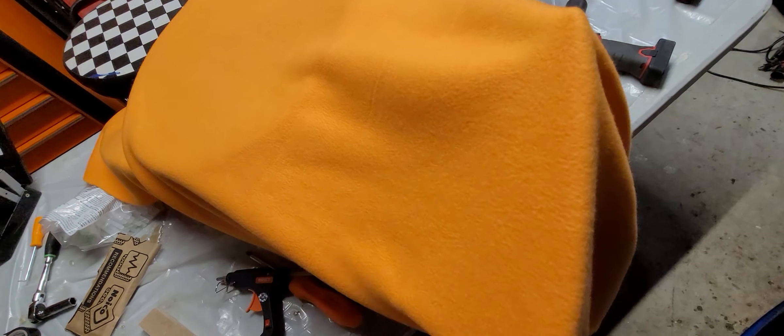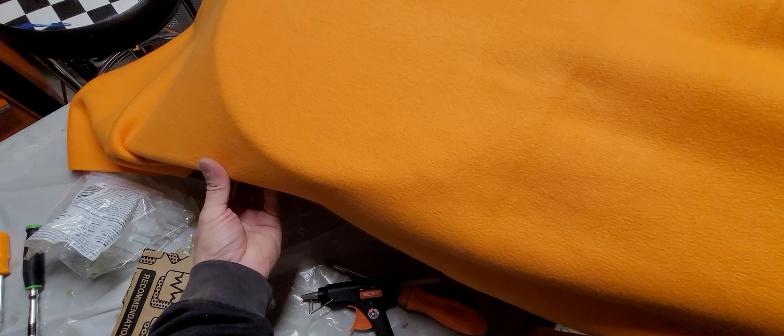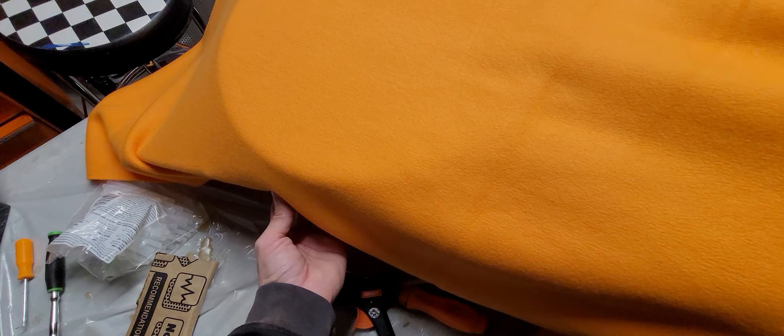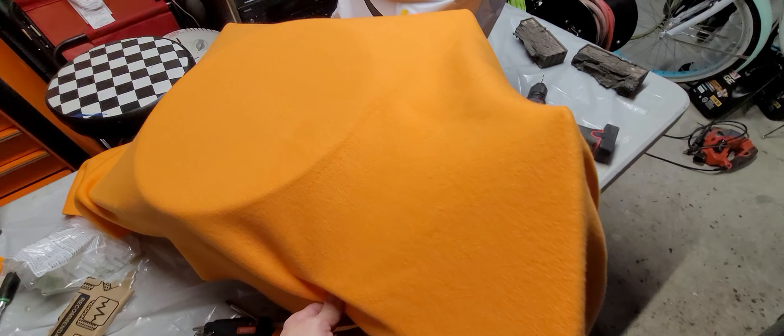It's easier to apply the resin to it. You're just draping this whole fabric over here and you're stretching it around the back of that shell, just like that. Then you're going to resin all the way around this corner where my thumb is, and all the way behind the box — maybe about an inch is what I do to seal it up. But all this stuff will go away once we stretch it over there.